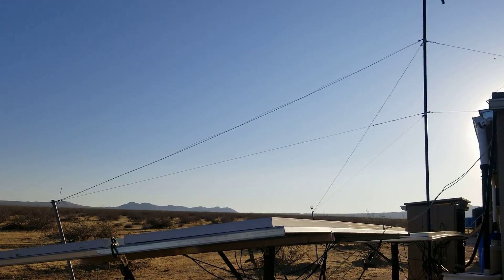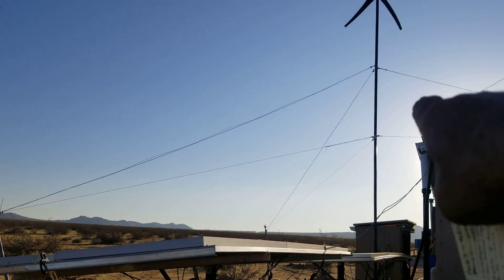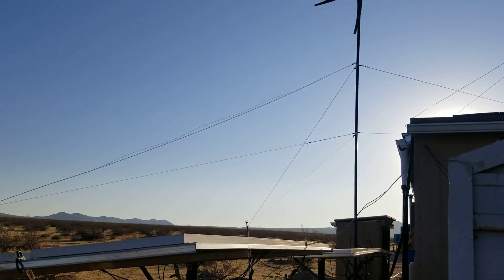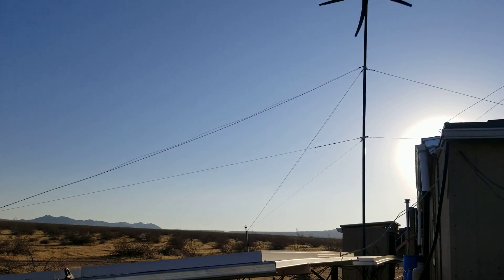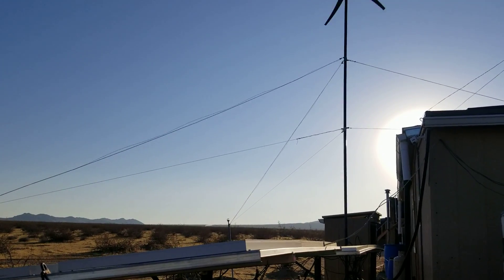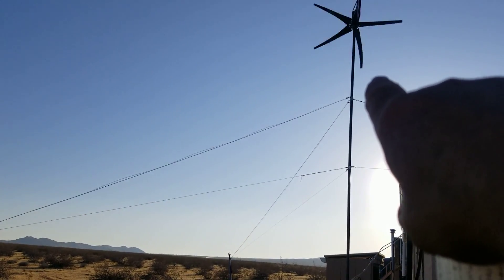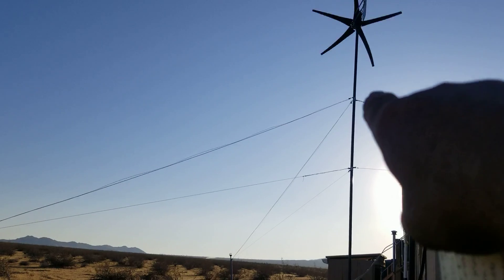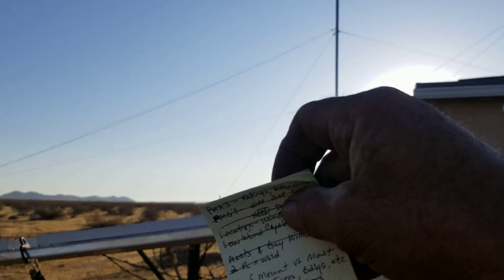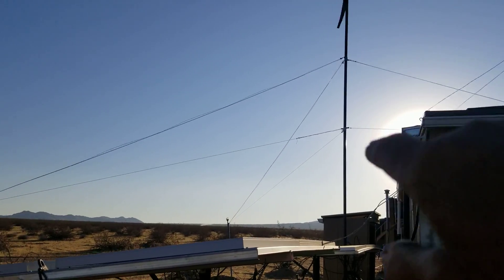So we were talking yesterday about guy wires — as you can see I've got three guy wires on the top and three down lower. That's because I'm using a one-piece, one-and-a-half-inch steel gas pipe as a mast, 21 feet high. And because of that, if I just put the top guy wires on, that would act as a pivot point and then it would want to flex down lower and do a Hawaiian shimmy dance. So I had to add second guy wires down lower.